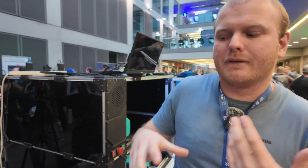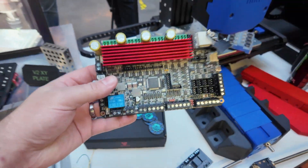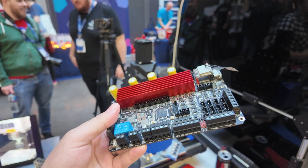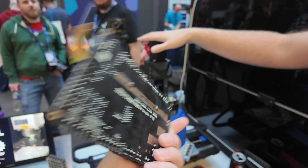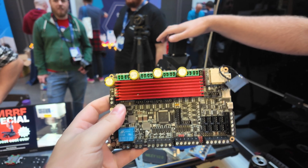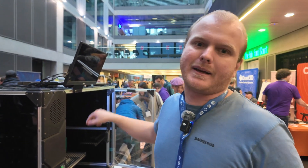One of the big changes is we've moved away from 3D printer boards in favor of our own CNC board. We worked with BTT to develop Sila, which runs 2160 drivers with an RMS current of about 4.7A and peak current of around 6A — so we're finally running motors at their rated currents. It also supports a separate motor voltage input up to 60V, which more than doubles the speed of the ball screws.